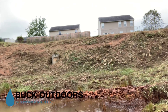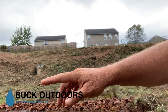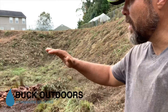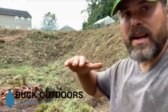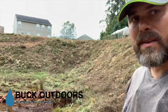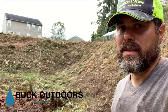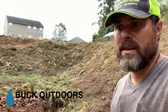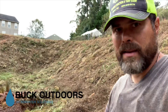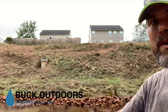And as you look out across, you can see — here's the riser, and then this little dark spot that you can barely see is actually a 36-inch pipe. The sediment is so high that we're standing at a higher elevation looking down and can barely see it. If we get down low and check the elevation, the sediment is actually higher than the top of the pipe. That's a problem, and the county is most likely — and I made this number up — 98.3 percent chance they're going to tell you that sediment has to be removed from the forebay.